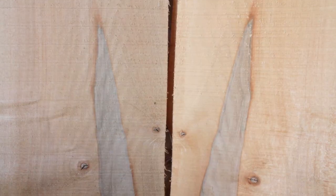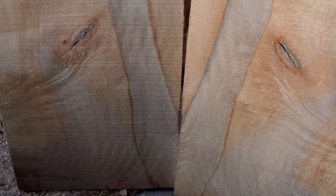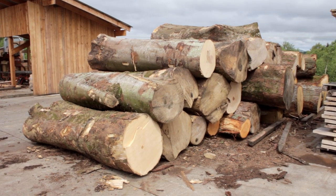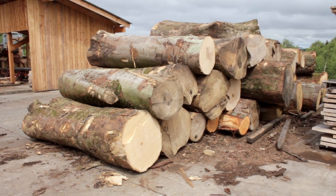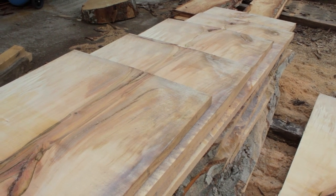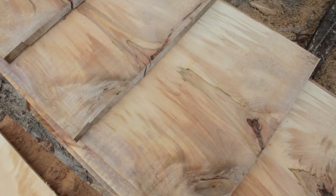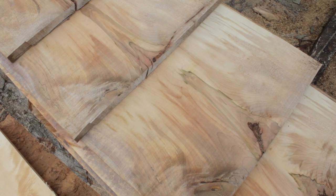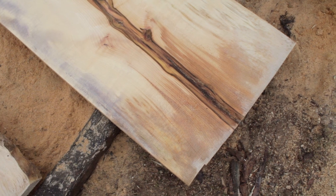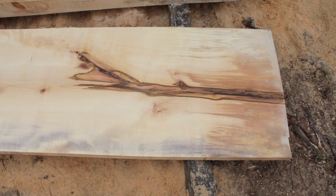As I said earlier, these were blown down at the end of November when the sap was low, so this level of staining is light — but it is there because we've left it a whole seven months before cutting these logs into boards. Ideally, we would have had all of these cut within a few weeks of them coming into the yard, but life isn't always that simple. However, this level of staining and discolouration is low. If it had been summer felled, then the staining in the tree would be much more, and would be throughout the length of the board, however soon it was cut on the saw. And here we see that darkened centre again — remember, this is different to the staining I was just talking about.